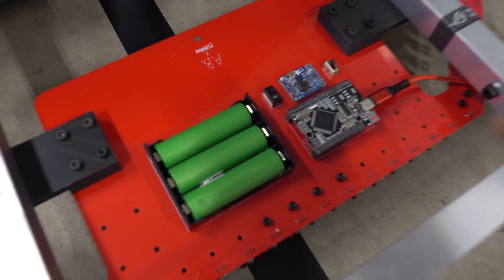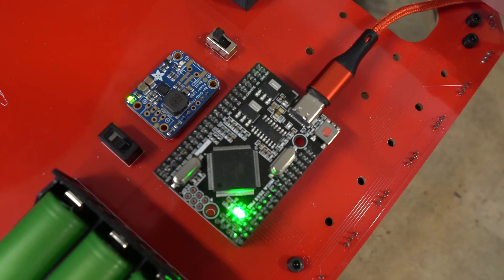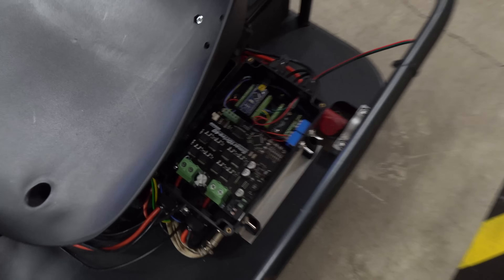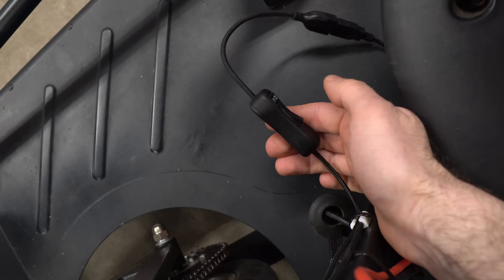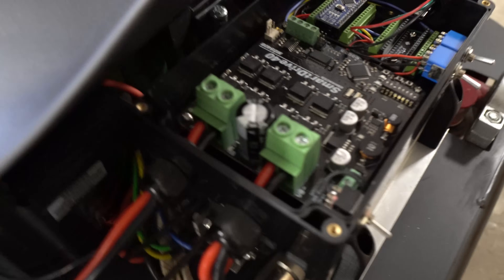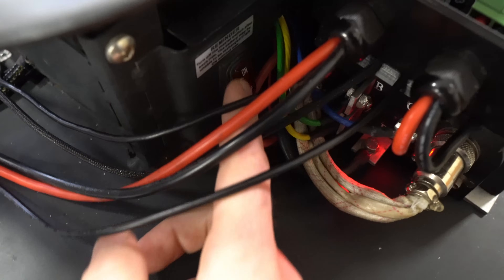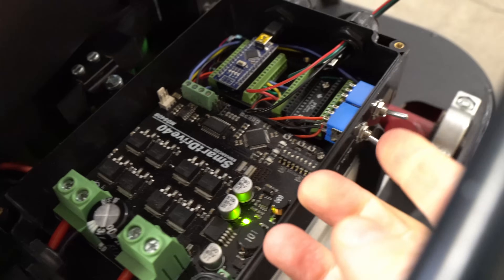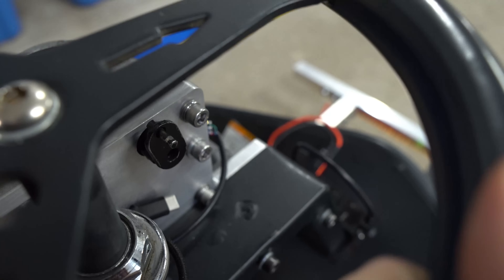Here's a quick demo of how I power this thing up. This switch provides power to all of the sensors. Then there's another power supply which provides power to the Mega Pro Mini, as well as to the Arduino Nano that's running my servo motor sketch. That Arduino is also connected to a USB power switch. This is the power switch for the DC motor driver for the steering motor, and this is the power switch for my speed controller. This switch turns on and off the PWM signal being sent from the Mega Pro Mini, and finally, this switch engages the steering motor.